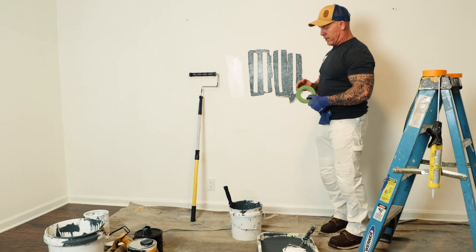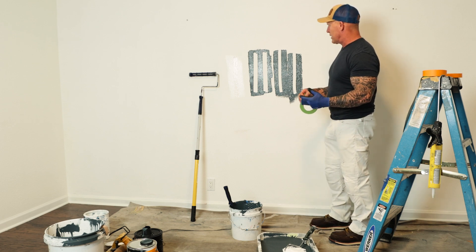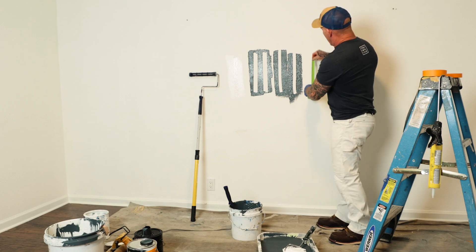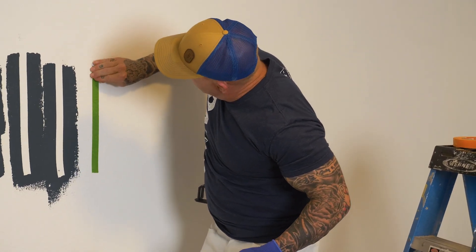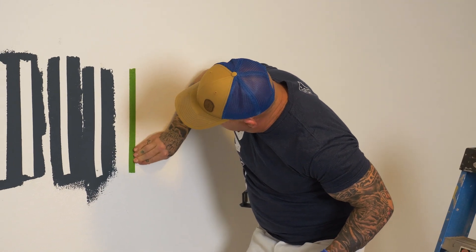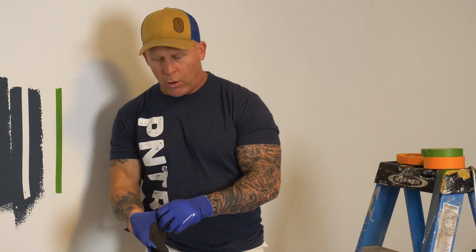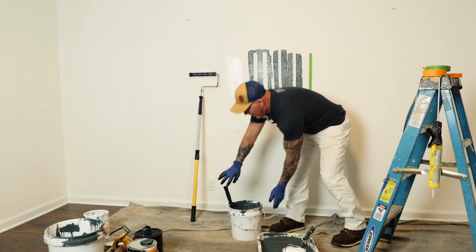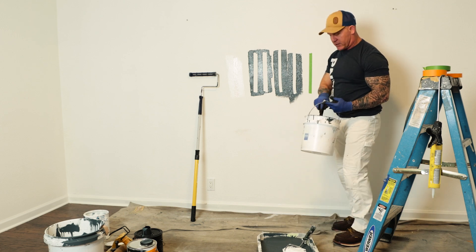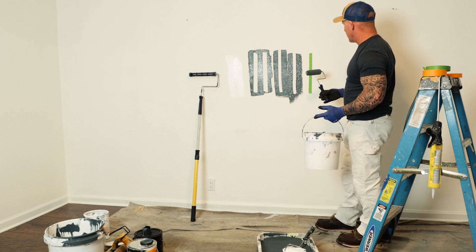One last tip: if you don't have access to caulking or don't want to use caulking, just use Frog Tape green. If you're really particular about pressing your tape down with the pads of your fingers, press it down really good and tight — it's going to mold to those peaks and valleys. There's a good chance if you're using Frog Tape green, Frog Tape blue, or Frog Tape yellow, they all have the same polymer on the outside. Frog Tape yellow is for delicate surfaces; Frog Tape blue is the same as green but comes in a multi-pack so it's cheaper.